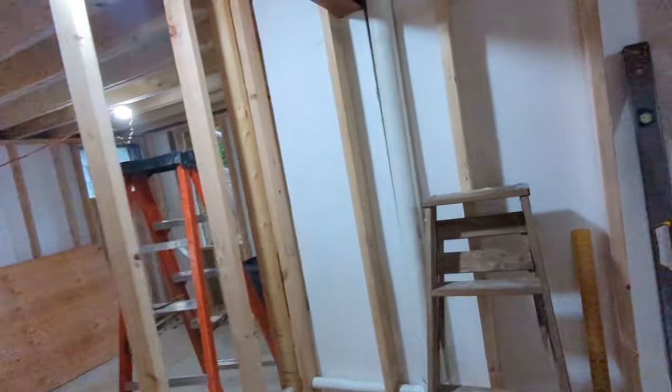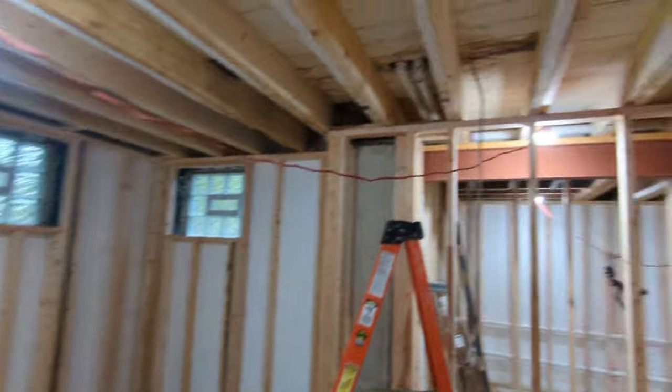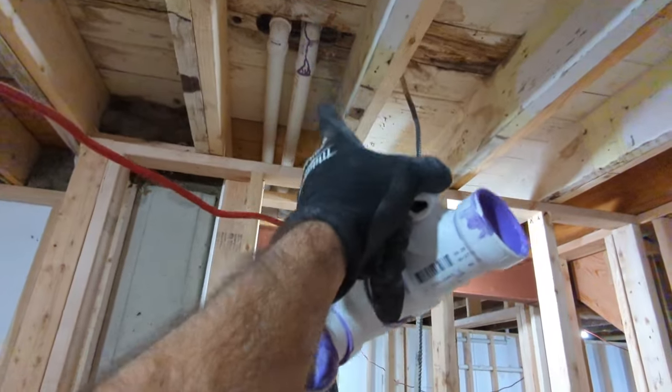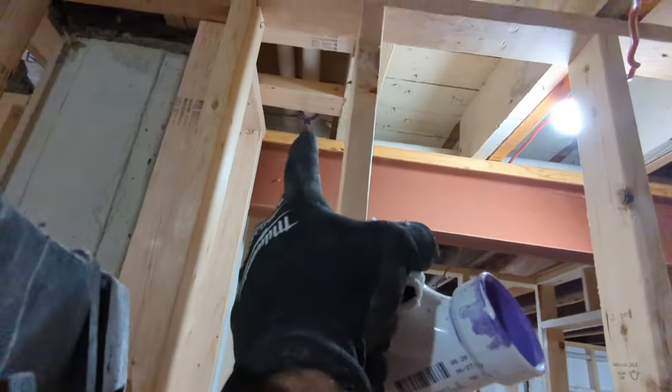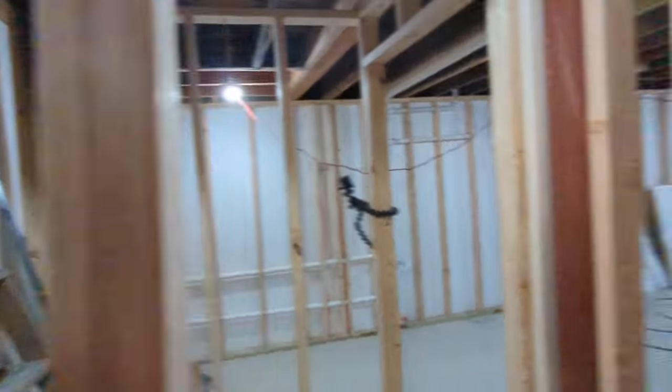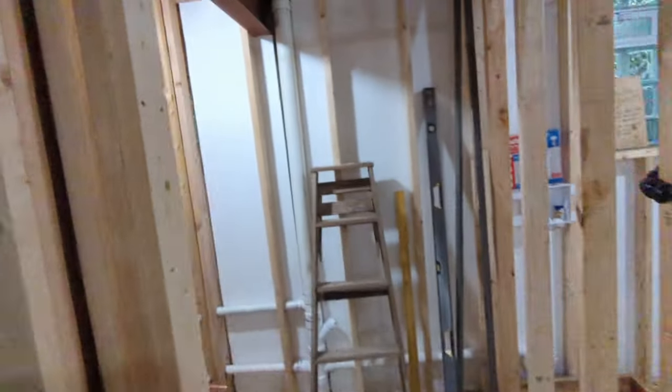It's tricky. Because over here in this kitchen bathroom, or this first floor bathroom situation, I had hoped to do just a drain line for it, and come down through a big sweep elbow to keep the fluids flowing easy, and through a combo fitting right there, which we talked about. It's a Y with a 45 built right in so that it takes off at a 90 degree angle. The connection is at a 90 degree angle to this axis, but you're joining flow through a 45 and then a Y.